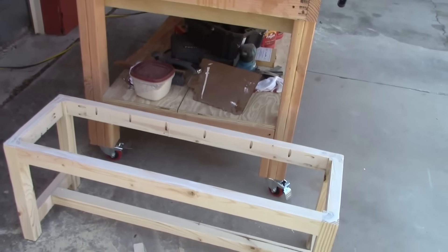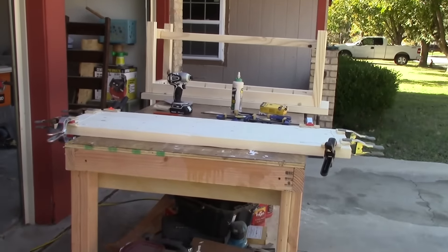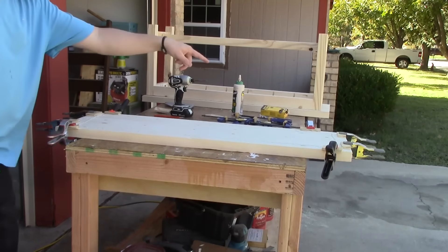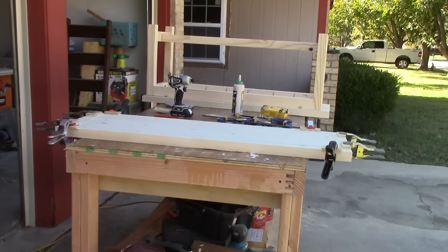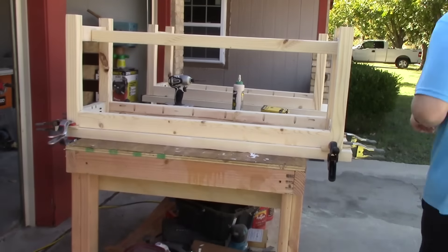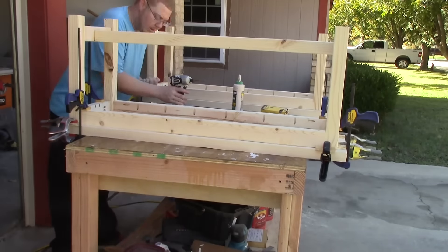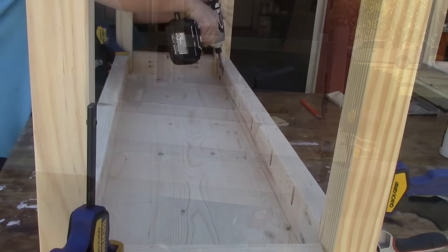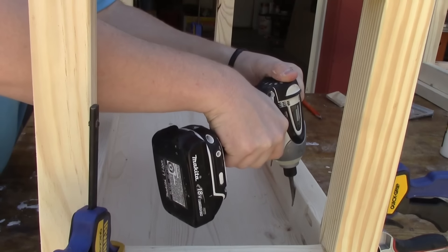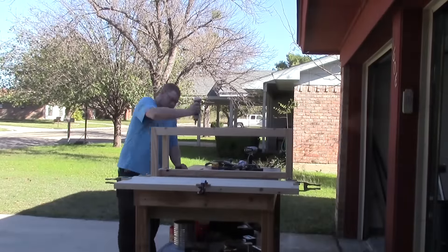I've got glue spread all over the bottom — or what's going to be the top of the bench where it's going to glue onto the top — and I've actually even run a bead of glue around the edge of this without smearing it out on the actual bench top. I have these clamps strategically placed all the way around so it will line up the bench when I turn it over. Once I got the base positioned where I wanted it, I went back and added a few clamps to help hold and pressure it, then squeezed some of that glue around on the bottom to get good coverage. I went back and added the pocket hole screws in each of the spots.